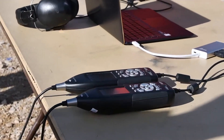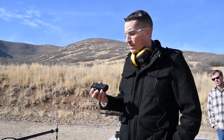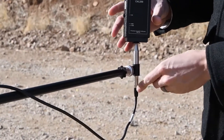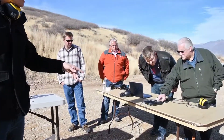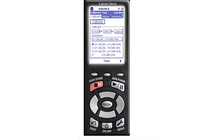We wanted the most bang for our bucks — we have one LXT at the barrel position and one near the virtual ear of the shooter position. Before we start taking a measurement, it's always important that we calibrate both of our meters. I'm using the Larson Davis Cal 200 and I'm going to calibrate on this microphone first. After we are done with our measurement, we are going to calibrate again so the data can be validated as good data.